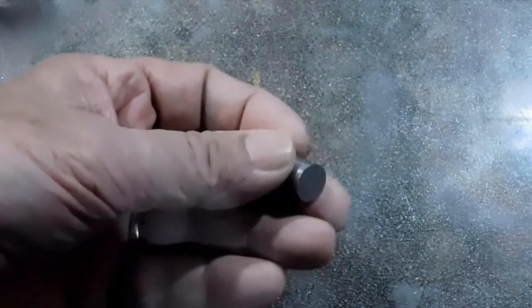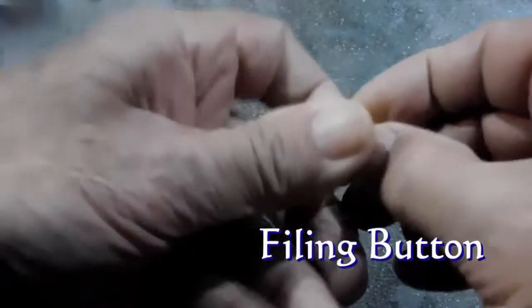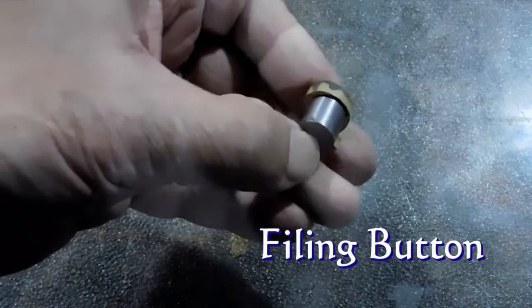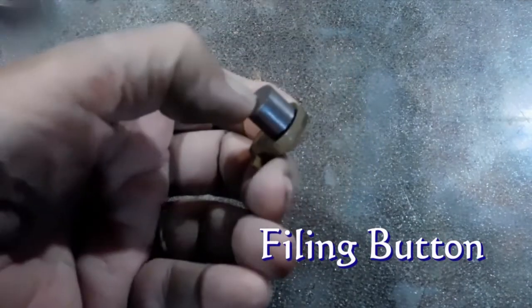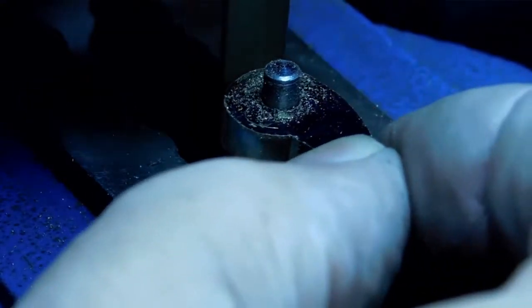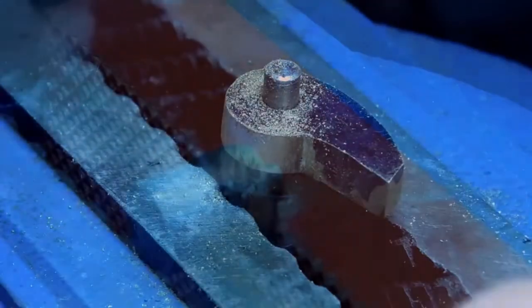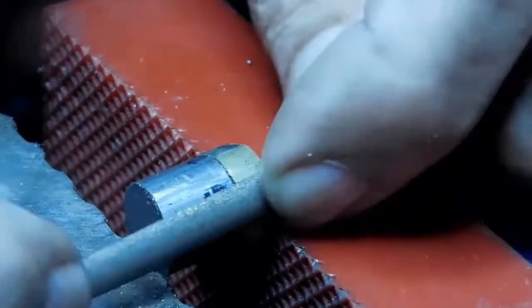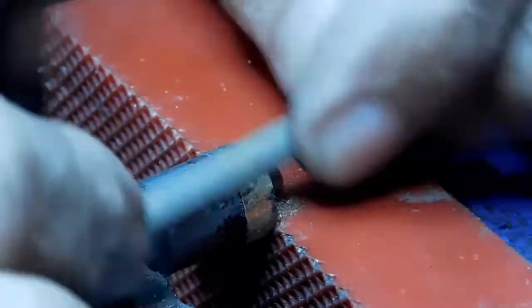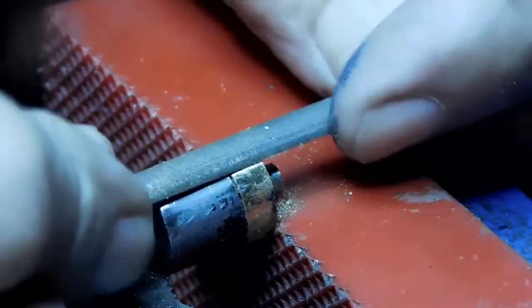To finish it off, I took a piece of cold rolled steel and made a filing button. Normally I'd case harden it or use tool steel and harden it, but not for this job — I don't believe that's necessary. I put it in vertically first and got my round shape using the button as a guide. Then I flipped it on its side and did a little cross filing but mostly draw filing to finish off the edges and make sure they're round.